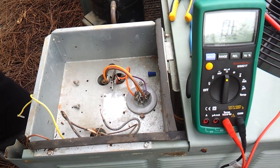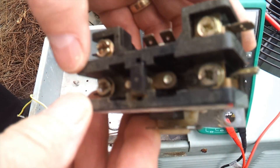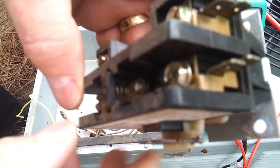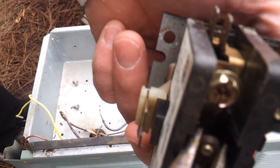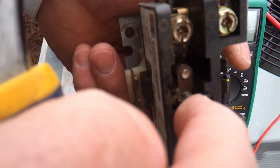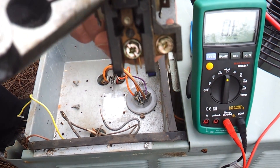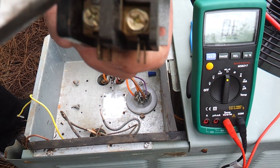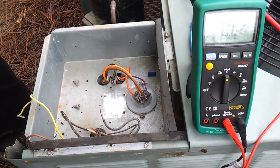We've got the power out. Now you can see on this contactor — it may be difficult to see — but these contacts in here are burnt and pitted. This will cause a voltage drop across that contactor, and it may not even make continuity at all, which in our case it was not, because our points are pitted. When the contacts come together it did not complete a circuit. Your power comes in here, goes to this contact through this little mechanism, contacting the other point and then going out to the compressor. So let's put our new contactor back in.